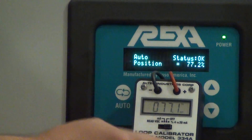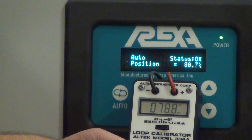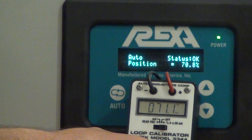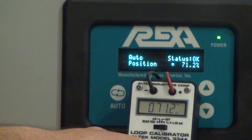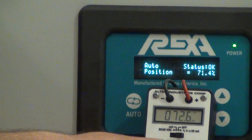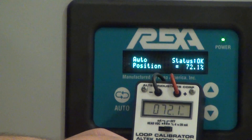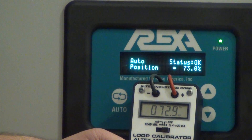You can also see on the display that the frequency response is very good — between 4 and 5 hertz depending on the model. So as fast as I change my signal, my actuator begins to move and stabilizes my process.